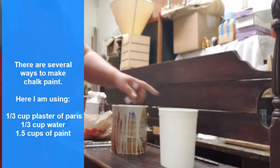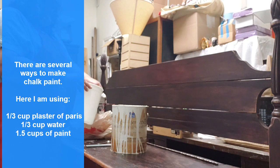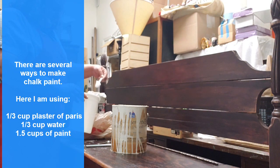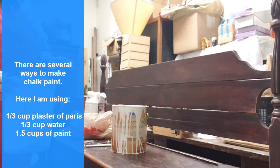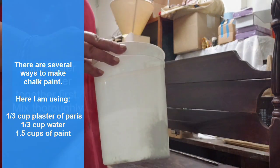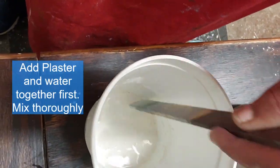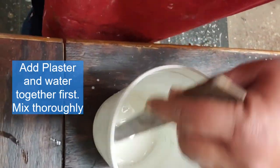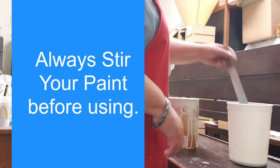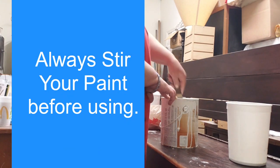Brad made it a little while ago. So I am going to be doing a chalk paint - it's our own mix of chalk paint and I've got the recipe posted. Most of the time when I make chalk paint I don't add a lot of water, but I wanted this one a little thinner and I added a little more paint ratio to the plaster. I wanted the brush strokes to kind of flood and disappear.